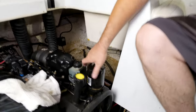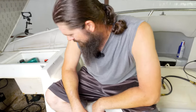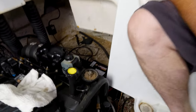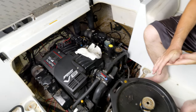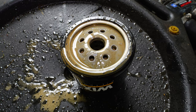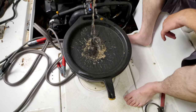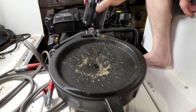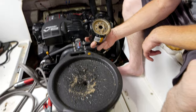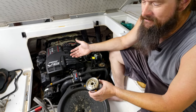Heads are coming off — that was water. There it is. I don't even need to cut that open. There it is — all water. That was all water. There's no oil. Oil level looked all right, but it's all water in that filter.